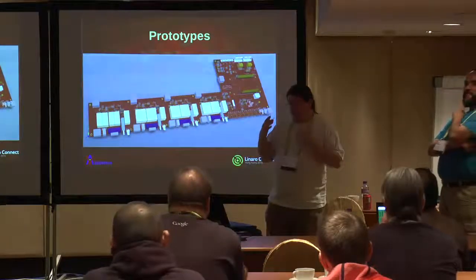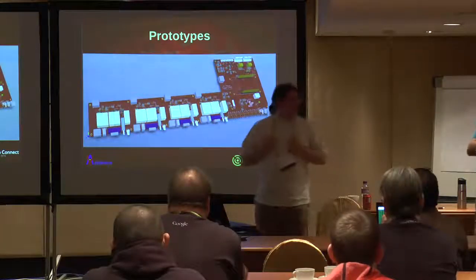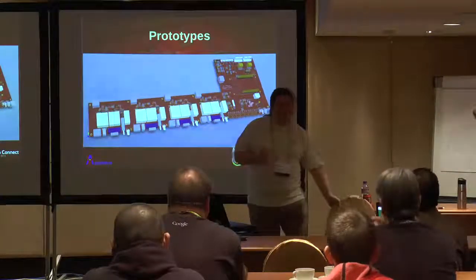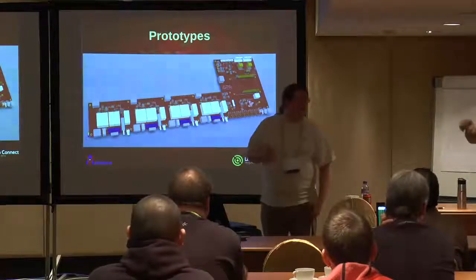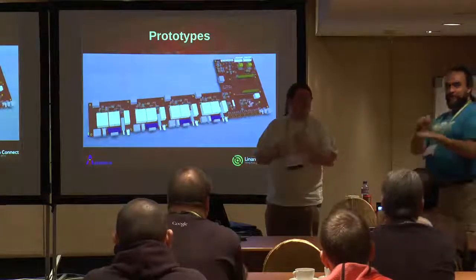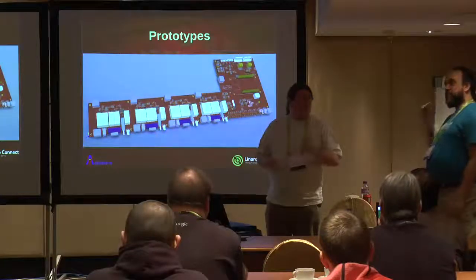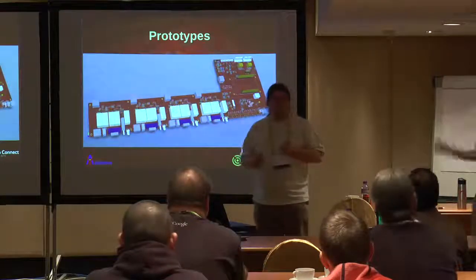Some devices, looking at nobody in particular, might actually have the paperclip solution. This avoids that problem because you just solder something either side of whatever you're trying to short, and now you've got it as a controllable switch. Except that's a 12-volt board.